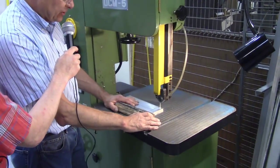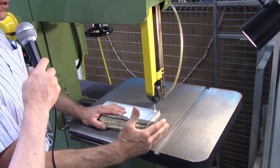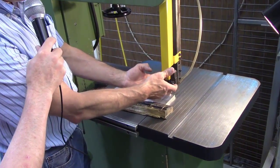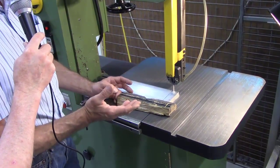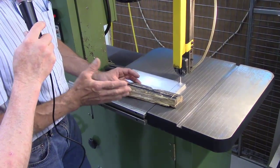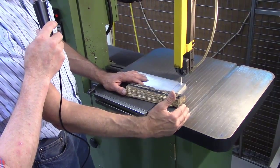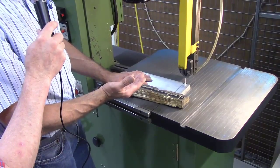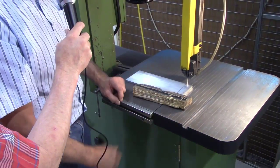So you're going to use this pusher. It'll help you guide. Some guys use the guide that goes in here. What happens is you have set on each side of this blade. Over time, they wear out, and the blade will cut one side heavier than the other, and it'll want to turn. It'll cut not a straight line for you. So then you have to rotate your part. And if you're using a saw guide over here, a part guide, it'll tend to end up binding your blade, and you won't be able to follow the line anyways. So I recommend grabbing a pusher, pushing your work through.